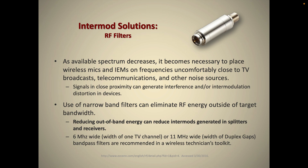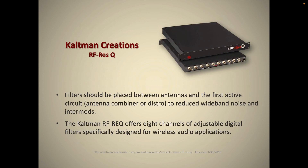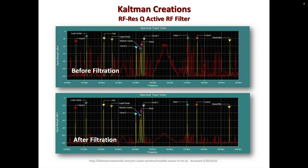There are fancier versions as well, such as a multi-channel filter which you can place in front of multiple receivers to isolate multiple TV channels. Here is a manufacturer document showing the yellow lines as the transmissions you want to catch and the red as the RF background interference you're trying to avoid. These filters are actually adjustable in width, so you can cut out and reduce local noise quite precisely.